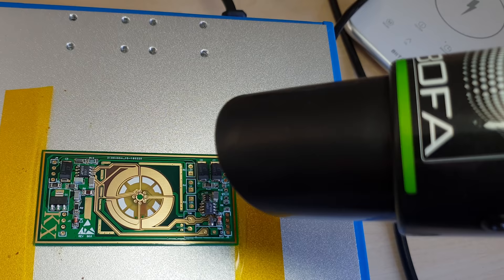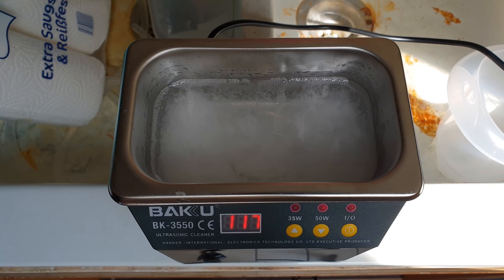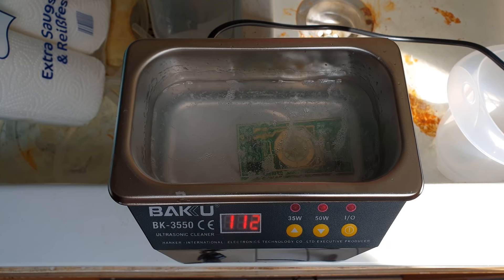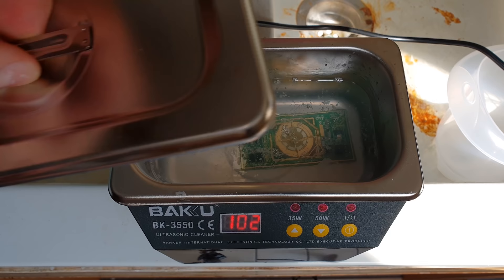Next I would populate the through-hole components, but those are on another sensitivity level entirely. I don't want to subject them to cleaning, so I'm going to do that now with the almost-finished board. IPA and a swirl of acetone is highly effective but not aggressive enough to infiltrate plastic IC packages. And obviously it's a terrible idea to use flammable substances in an ultrasonic cleaner — it's a fire hazard and not even proven to be better than a good old coarse brush. But this time it resulted in nothing but presentable soldering results.